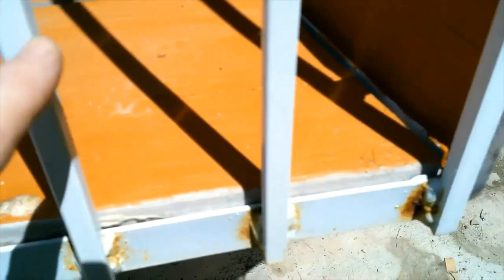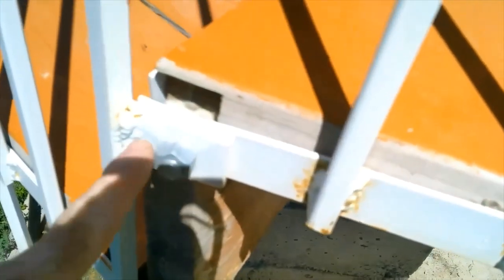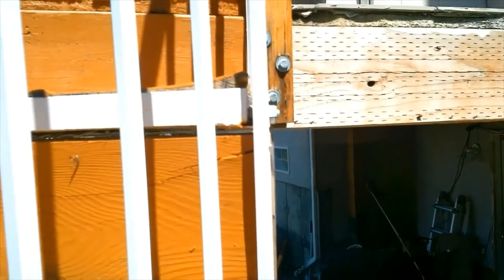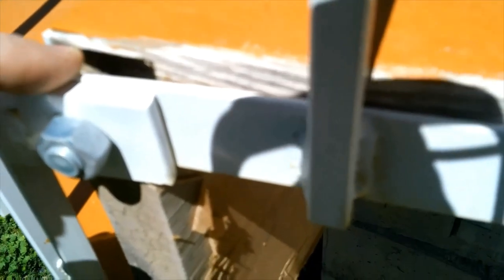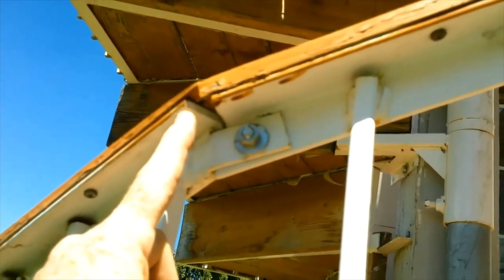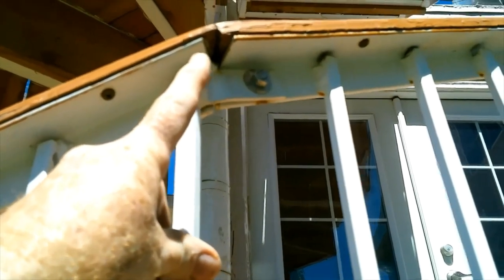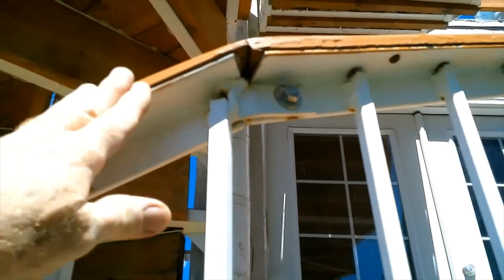Where the railings were square tube, the last railing was solid steel — solid steel to allow for strength, with a tab welded on to connect it to the tread just above it with a half-inch bolt. So this tread would be bolted to that tread, and so on and so forth. A section of the deck wood was routed out to make room for the head of the bolt on the other side of the nut. Because I was using a simple chop saw I wasn't able to make compound miter cuts, so there's a V-shaped opening at each intersection. That didn't bother me because I was able to cover it up when I put the wood railing on top.